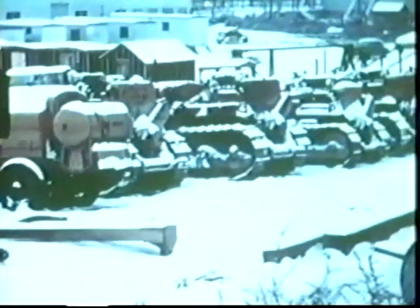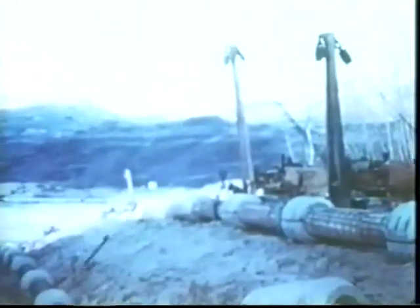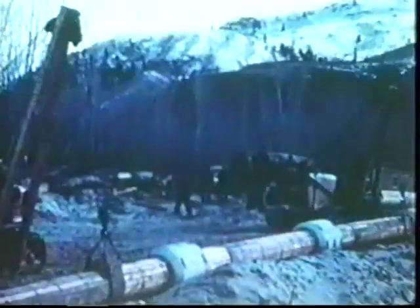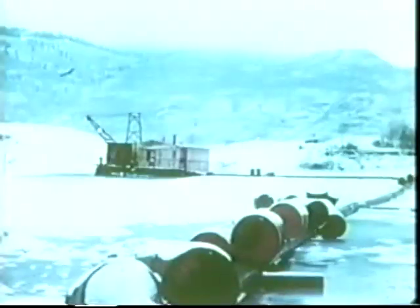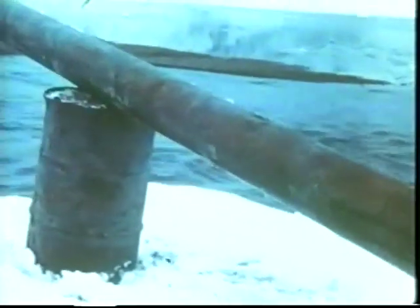On the outskirts of Kamloops, pipeline equipment lay in a storage yard awaiting reconditioning for its next season's work. But on the nearby banks of the Thompson, there was great activity. Its insulation protected by wooden slats and ringed with concrete weights, a section of pipeline was pulled across the river. A trench for the pipe at the river bottom was made by a suction dredge working in newly formed ice. The dredge had a small pipeline of its own to carry the sand and silt to shore. Taking advantage of low water, the pipeliners were installing a number of river crossings during the winter.